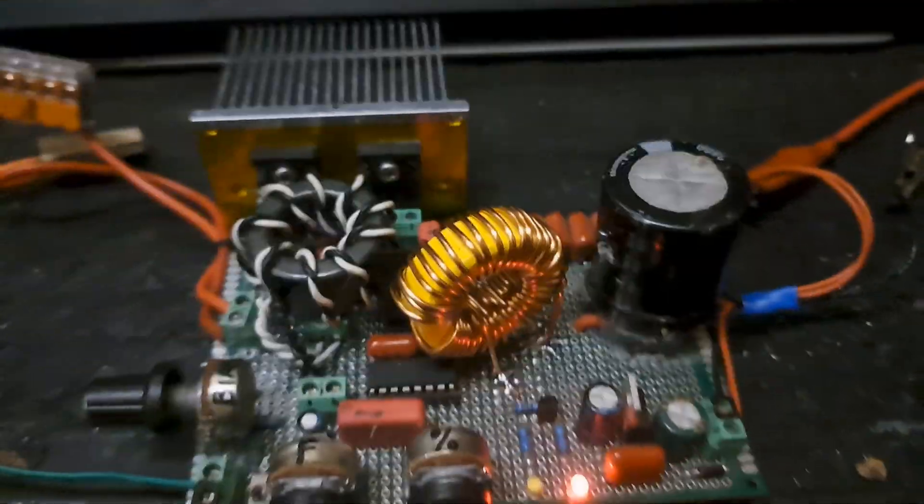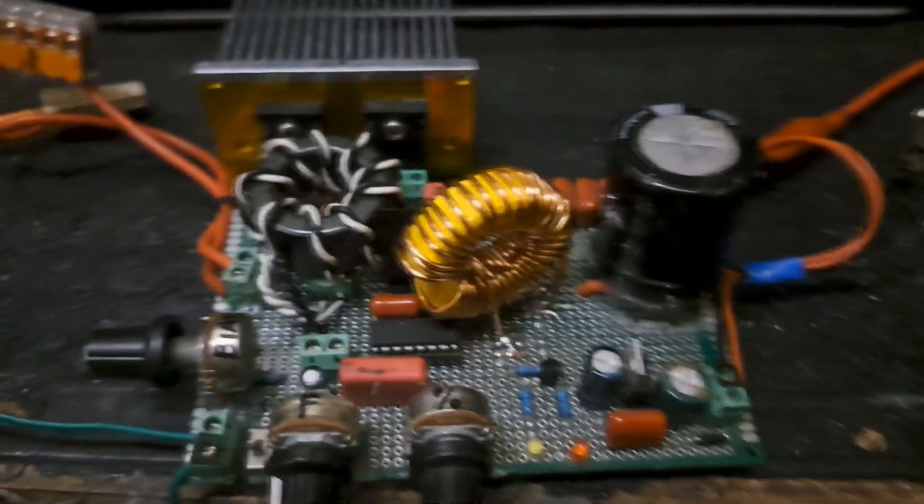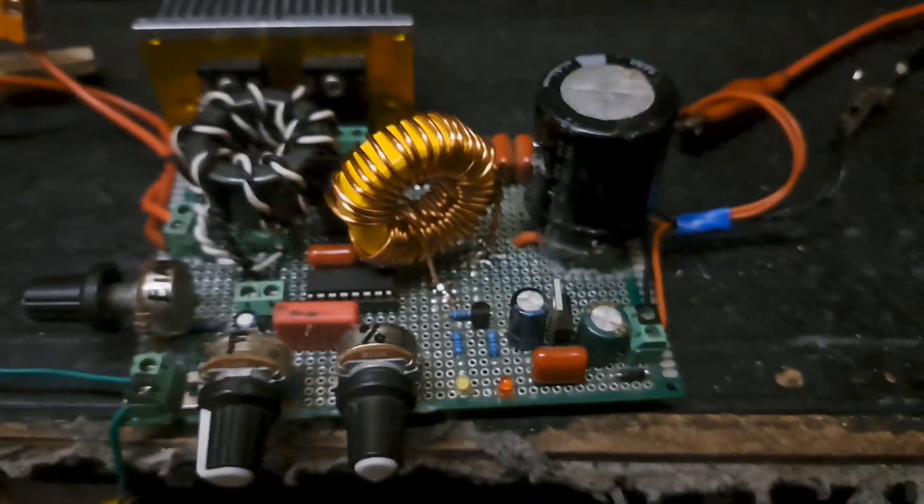A little circuit like that is pretty cool for the low voltages — that's the whole point of this one. I do know from experience that you can design these for a higher voltage, but I wouldn't really recommend it. If you really want to go too much over 50 volts or something like that, then you might as well just build a full bridge or something like that — half bridge, double the voltage, whatever.